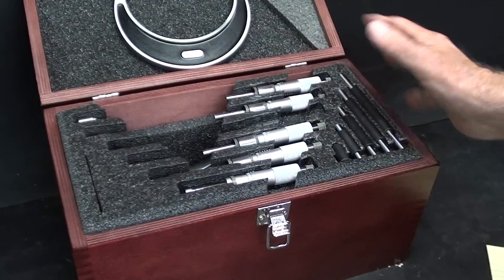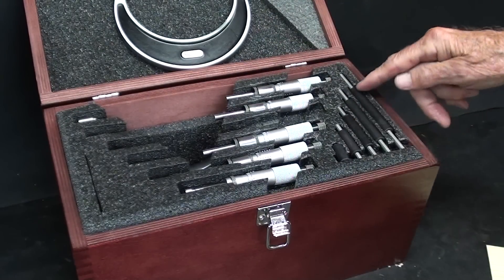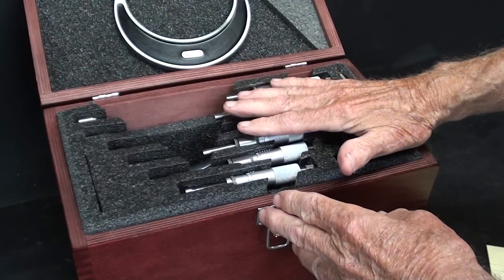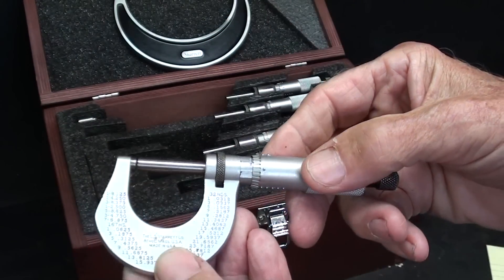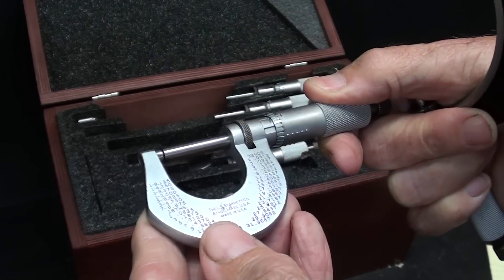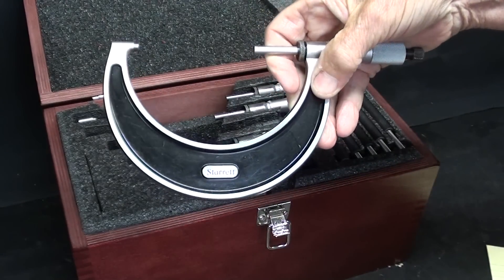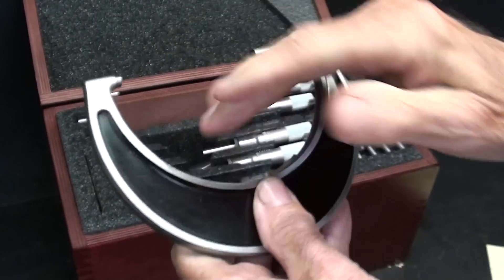Troy purchased this box so that he could ship these to me, because he doesn't own these micrometers either. He also bought the standards here — brand new insulated Starrett standards to check the micrometers for accuracy. It is a kind of a mismatched set; the most common size, the one-inch size, does show some wear and is not the same vintage. The rest of them are model 226, and they're just beautiful.